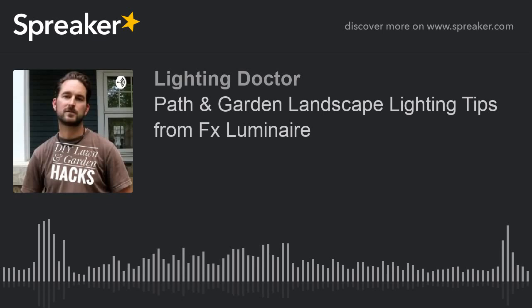We're standing in the lawn area — a play area and gathering spot in the evenings for families and kids. It transitions into an annual bed with flowers being changed out several times throughout the year, and we've got a fountain there as well. We chose path lights for two reasons: to create a barrier at night to separate this area from the planting and fountains so parents could see their kids if they started to run that way, and to illuminate the flowers. We chose the 18-inch risers over the standard 12 because we wanted more light output, to throw further into the bed and out onto the grass — it's more of a safety feature, especially since it is a public place.